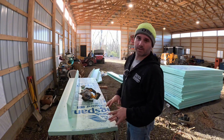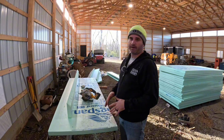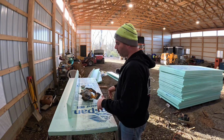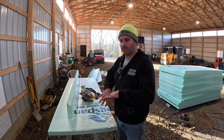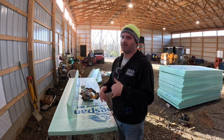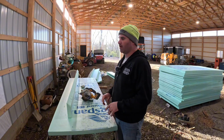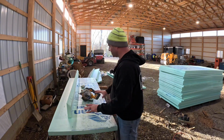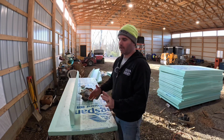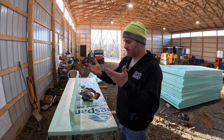On this episode, we're going to talk about energy efficiency. Some of the new building code requirements in this area, and it's all over the United States, is they're starting to make you put foam board insulation down into the foundations to keep the ground temperature from coming up into the house. So I believe if you dig down into the ground like 5 or 6 feet, the ground stays like 52 degrees somewhere around there year round. So what they try to do is get this foam board insulation and glue it inside of the block, keeping the dirt, coldness coming through the block foundation and up into the house.